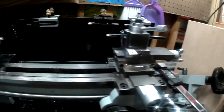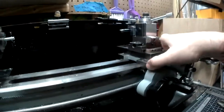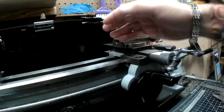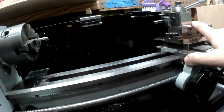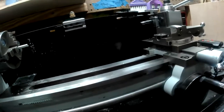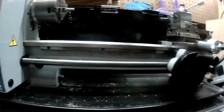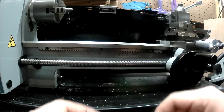The reason we're actually going through all of this - just to take a little step back - if there is looseness in here and there is play in this casting, when we're actually moving in to start machining a piece of work, there can be vibrations, there can be movements that create tool marks and chatter on our workpiece, and that's definitely not good. So I went out and I found some plans, which I will link in the description, for the top-adjusting gibs.